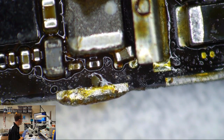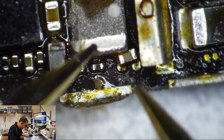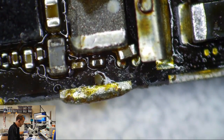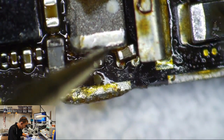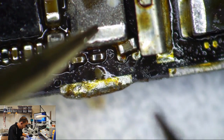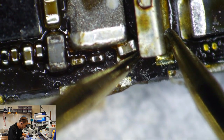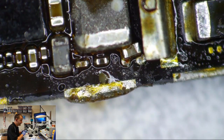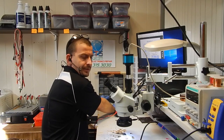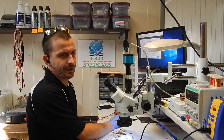I do have PDFs of all these schematics. Back over to the microscope — I'm going to check for a short to ground. We have no short... wait, it helps if I turn my multimeter to beep mode. Yeah, we're shorted to ground here, and it's not supposed to be. This pad is ground, but this pad here is not supposed to be ground. ZXW just finished crashing, so let's do it the old-fashioned way. I have most of these schematics in PDF.